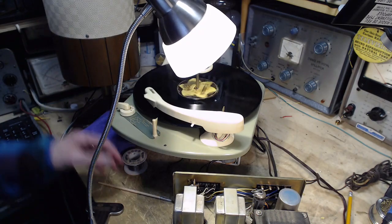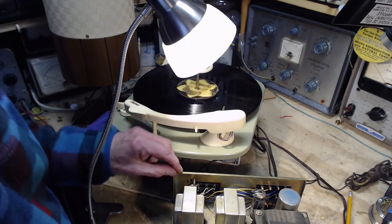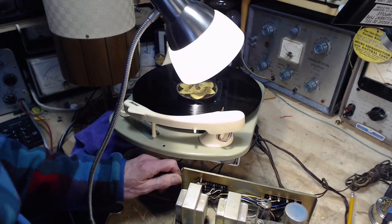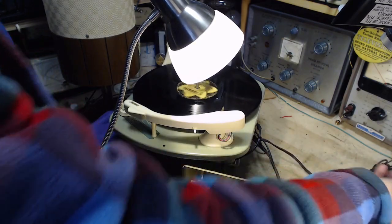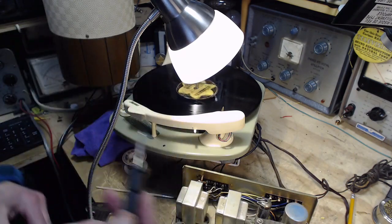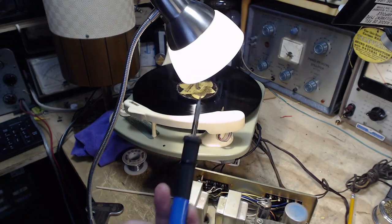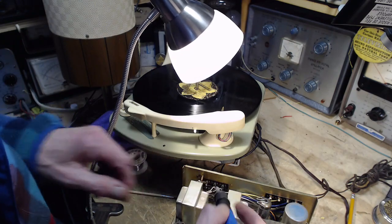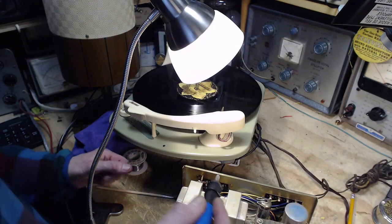I can't see it, but obviously something's loose in there. Just do some kind of general soldering. Could be a cold joint. I'm looking at it, it looks fine, but it's actually not. Soldering iron still going. I better unplug this. In soldering, often the tip is grounded, and it shouldn't matter with these inputs, but famous last words.